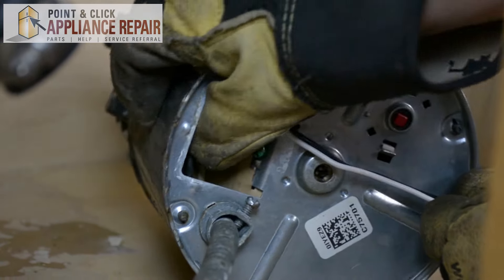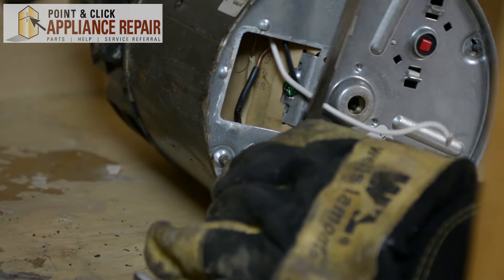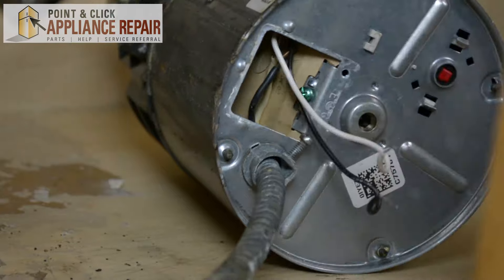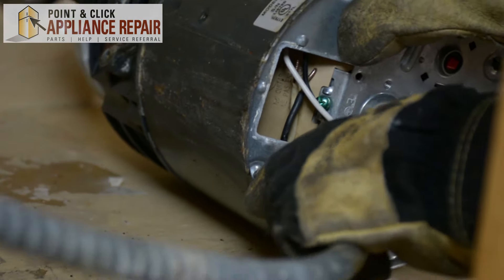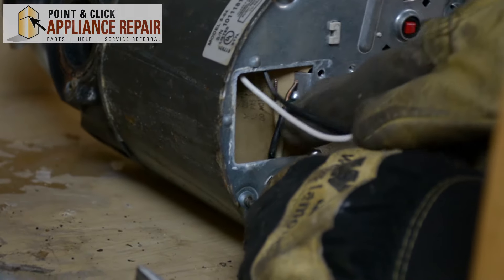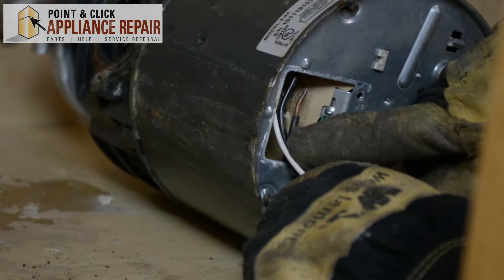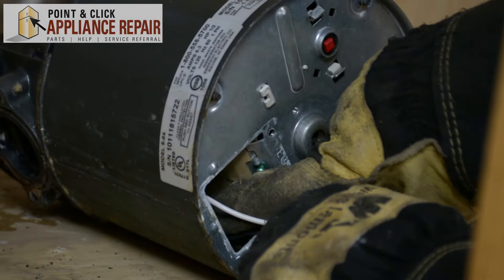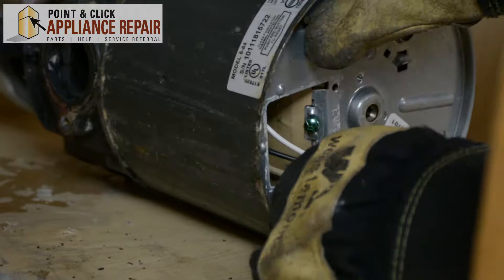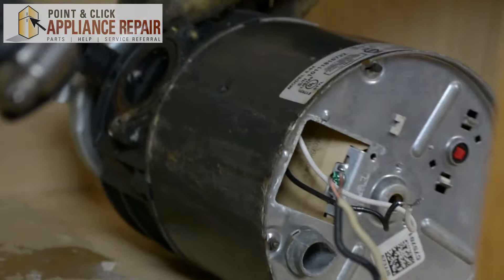We're going to have to get these out now. The next thing we're going to do is loosen up this screw here. Once that's loose enough, it should just pull right out. With these wires here, they're a bit rigid, so we just have to kind of bend them so they're straight, and then we can pull them out. And now we'll get rid of our old disposal.